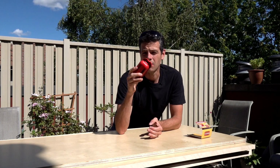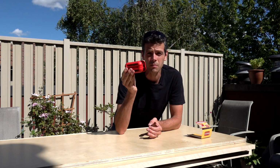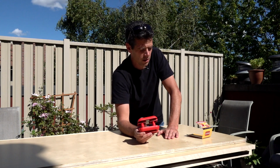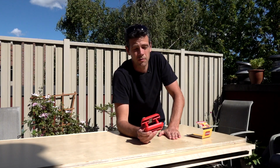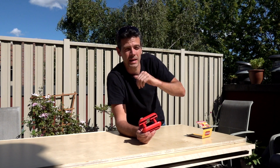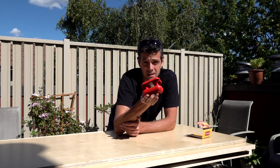very nicely. So yeah, this one has two sides. So if one side gets dull, I guess you still have the other side, but hopefully it keeps an edge for a long time. So today what I have is some pre-finished birch plywood with some iron-on edge banding. So wood edge banding is especially difficult because it has a grain and the blade likes to follow the grain and it likes to split it and lift it off where it shouldn't. So I'm both skeptical and excited to try this to see if it works.